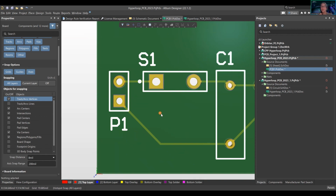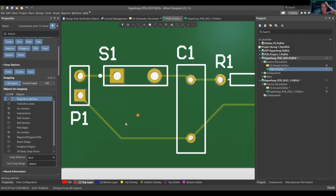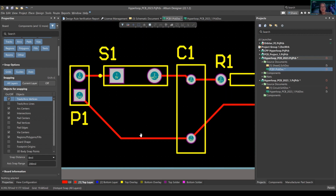Sometimes it's a temperature test where we heat up the board to a certain temperature because we know that in our environment it's going to reach that temperature. Then maybe the solder might melt, and that's a really big manufacturing problem. So that's why we have solder masks, to get back to the point.